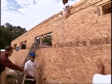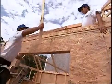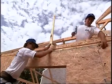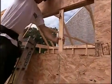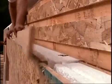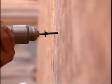There you go. From this way, corner. Yeah, from where I'm looking, it looks pretty beautiful, Frank. That is one of our rectangular window openings in the section of the barn that'll be our car storage section. Right, and it's all pre-cut. You'll be ready for your window installation in a matter of hours here. Now, what's the plywood for? Plywoods are the actual splines that secure one panel to the next, which makes it act as one uniform panel the entire length of the building. I see. And also help to seal that joint. Okay. Although we will also be inserting foam into that joint. There's a foaming groove inside the panel that will foam into to seal.